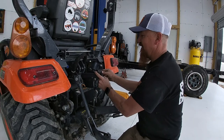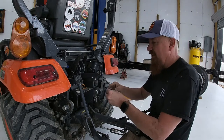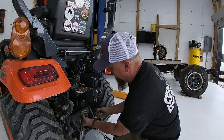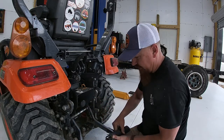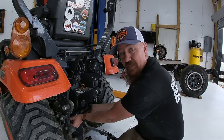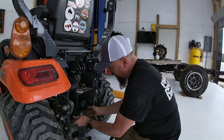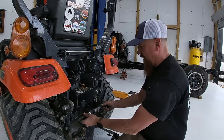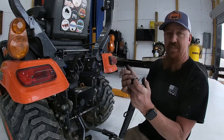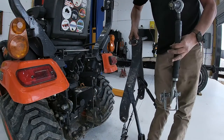Pop those pins off, and as I take these out I always just take them and stick them right back through and stick my pin back on so they stay together and we don't lose anything. Now we've got those bars loose — slide this little hair clip out and pull that pin out, take this off, put it right back in there so it stays together. Then slide those two together and pull these two inner bushings to the side, then slide this bar right into the hole on one side and out. I always take these and put them on the end of the top link pin so they're always in the same place.